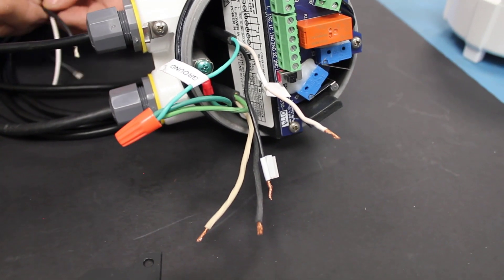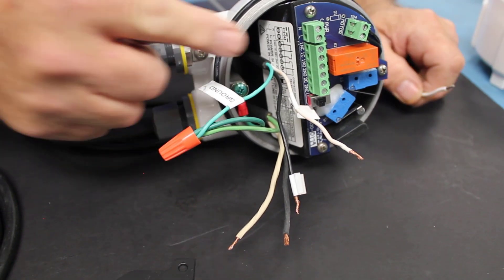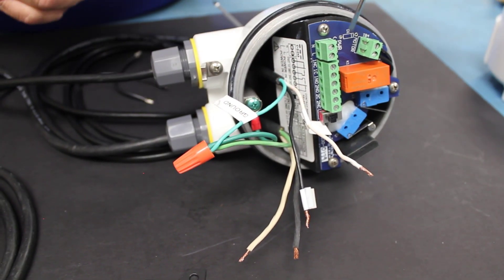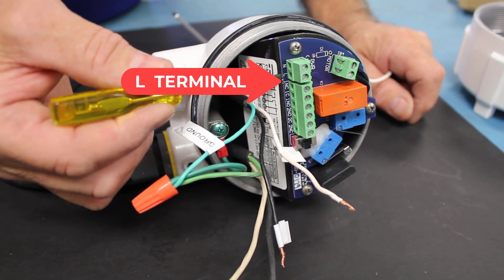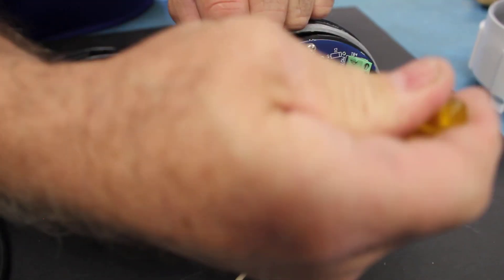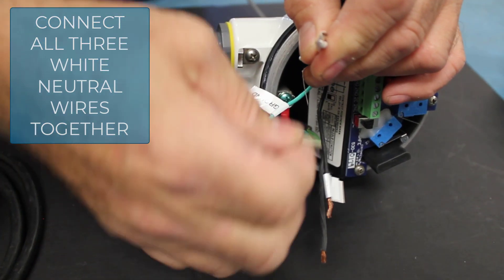To make the connections to the circuit board, since I'm going to have two neutral wires to connect, I'm going to use jumper wires to connect directly to the terminals on the circuit board. There's a two-terminal block on the far left labeled 'power' above it. The farthest left terminal is the N terminal and the one just to the right of it is the L terminal. The N terminal is for the white neutral wire, so we're going to connect a white wire there and secure it in the terminal.